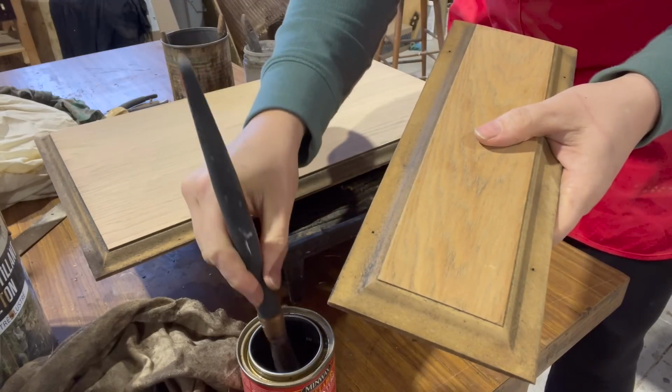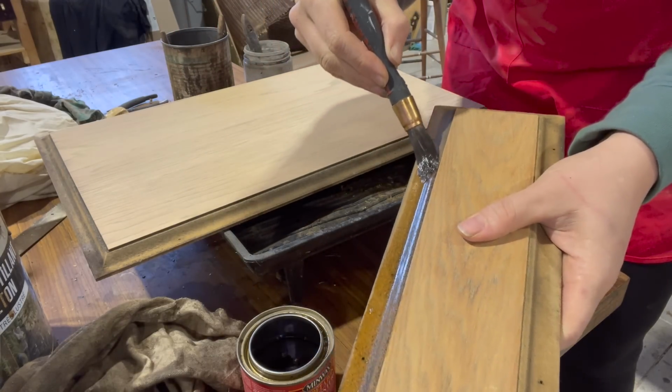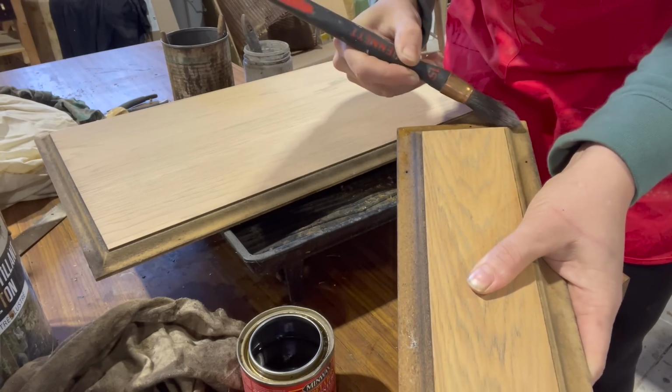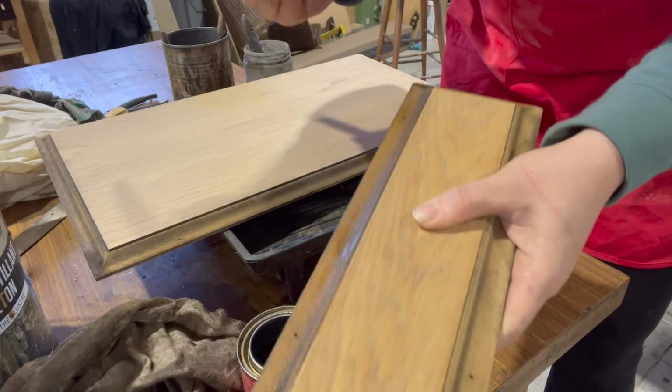so you don't want a really dark stain to go into this raw. So I'm gonna be using a wood conditioner here, and I'm just gonna pre-treat these edges because I don't want my stain fully penetrating into these. And then I'll install them.